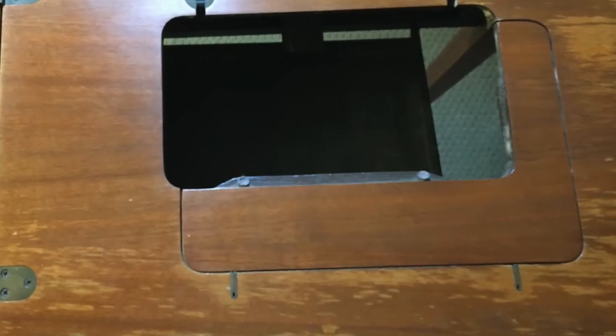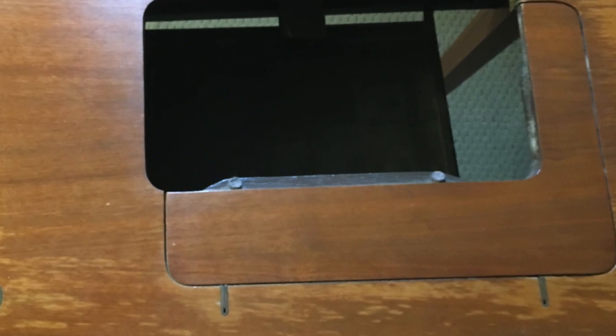Obviously your experience is going to differ depending on what kind of piece you're working on. You may have to glue legs back in place, or you may have to unscrew parts to clean around bits and pieces before you put it all back together. The other thing is that with this cabinet, I did not actually take any of the hardware off or take any of the pieces off, and that can make it more difficult to get down into nooks and crannies and really do a good job of cleaning. But at the same time, with an older piece, you can risk stripping screws and things, trying to get them out when they haven't been touched in 60 or 70 years. So that was sort of the trade-off, and I just decided to leave the hardware alone, work around it, and do my best to clean everything without removing the little front door or without removing the hinges for the lid of this piece.